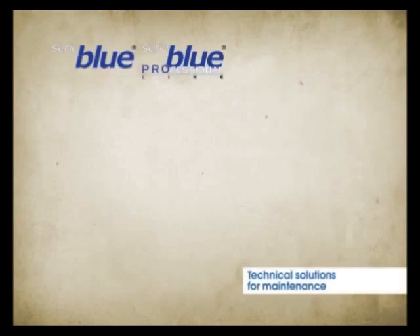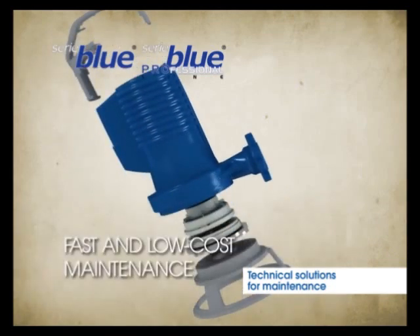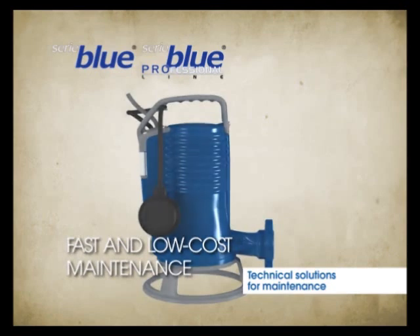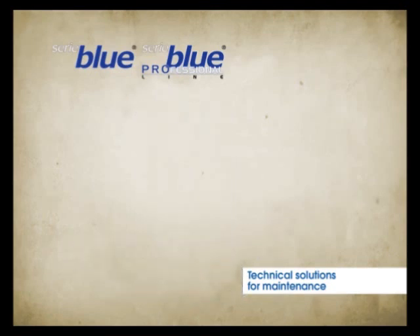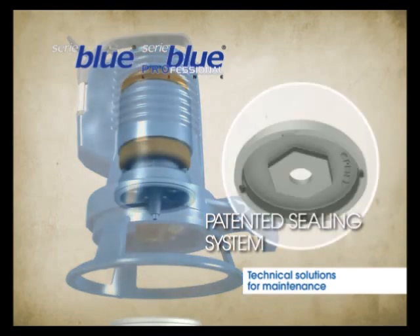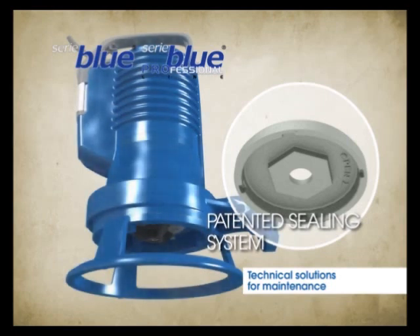Zenit invests its experience in designing and making products that are easily and fully repairable. The Blue series, being entirely made of cast iron and having inherited technical solutions designed for more industrial products, can quickly and inexpensively be disassembled and repaired. What distinguishes the Blue series is the patented closing system: the electrical and mechanical parts are closed with one single component, the oil sump flange, in which part of the oil chamber of the mechanical seals has been incorporated. This component is screwed on using a simple cup wrench, and one O-ring in the pump motor section seals the system.